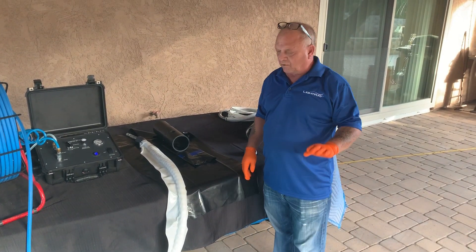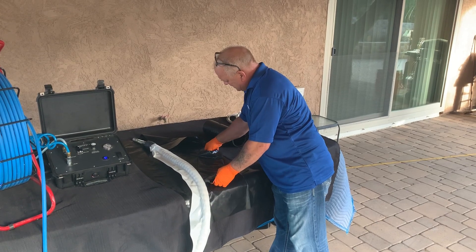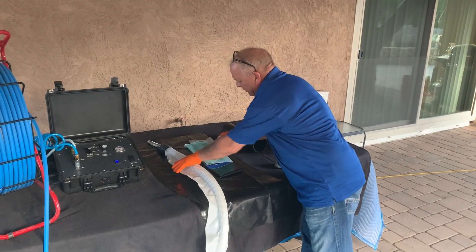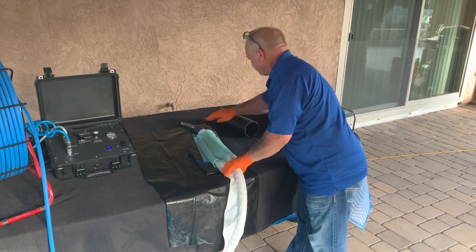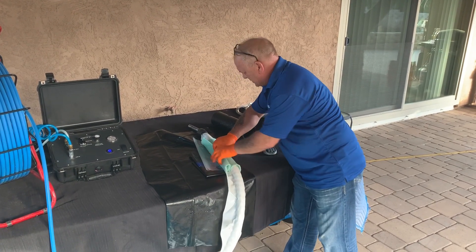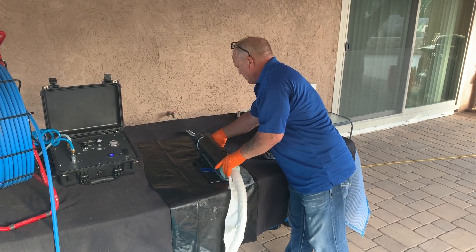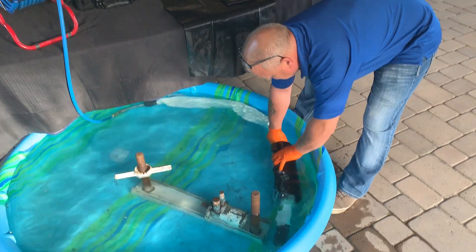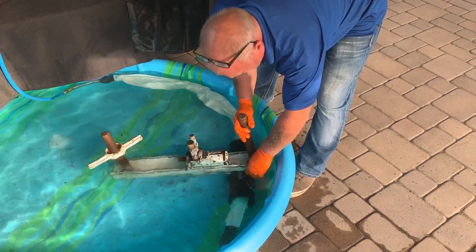There's a lot of confusion going on, so once I get into place I'll talk a little bit more. So we have the packer on the back end. We're going to take a four-inch liner, pushing it to protect the sleeve. For this demonstration I'm just going to place it in place. Roll it a little tight, slide it into the pipe. And we'll place the whole device underwater. I've cut holes inside the liner, inside the pipe, so we can see the effects.